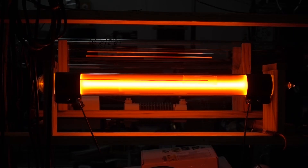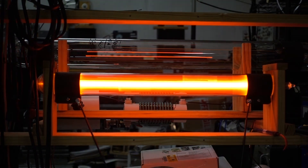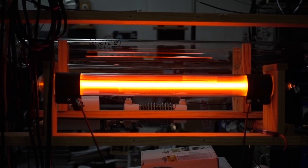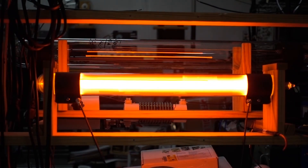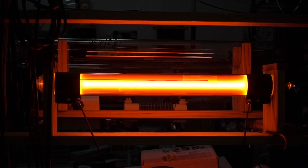Right now the tube lights very easily at 57 volts. In fact it's lighting at 38 volts, though the waveform isn't the best so I wouldn't recommend that. At 0.8 amps, that's looking good. The tube is working fine now that it's cleaned up a little bit. We'll run it some more at high power and let it get hot again to see if we get any more gas discoloration. Right now it looks very good — nice and clean with a normal neon orange glow. I will let this run for about a half an hour and then proceed with the test.